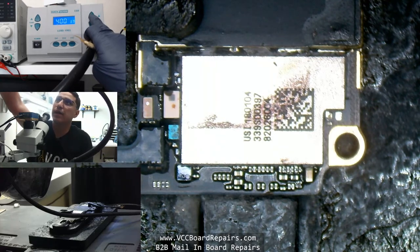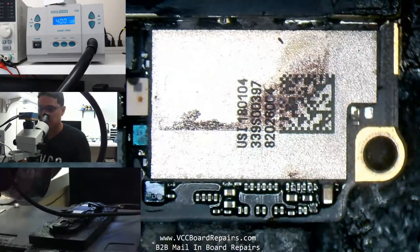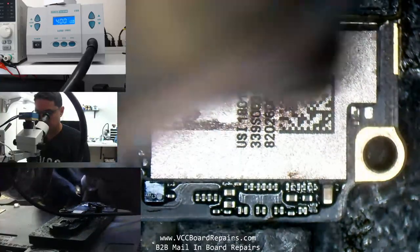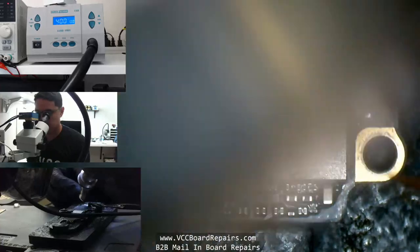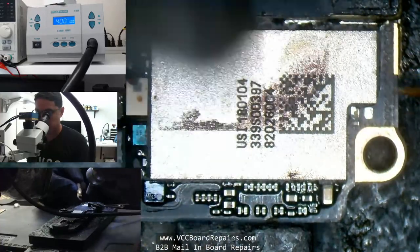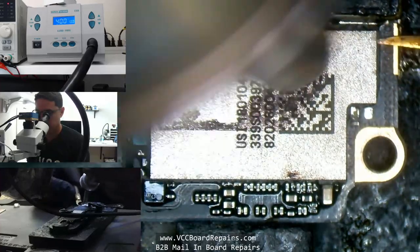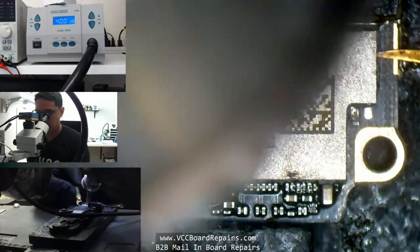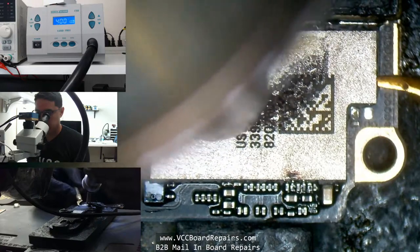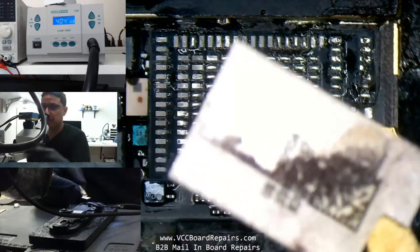Now I'm going to remove the chip. I do that with 400 Celsius and 100 air — basically just blast it. This chip has a lot of ground planes so you've got to use a lot more heat to get it off. I like to go in here in the upper right where there are a lot of ground pads, so it doesn't matter if I damage anything there. There it is — popped right off. It actually landed right on my tool.